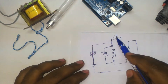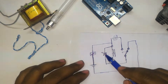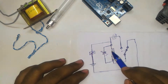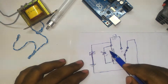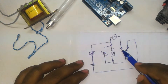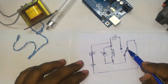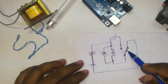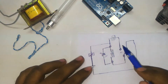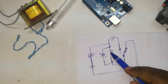At that moment the LED gets current from the discharging effect of the capacitor, so the LED is getting some power. When the capacitor is discharged enough and crosses the threshold value for maintaining this NC contact, the relay contact changes back — the NC contact returns to its previous state and the NO contact is open again, so the LED stops glowing.